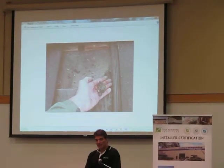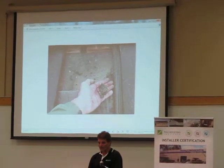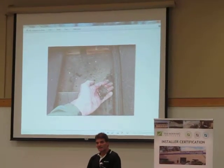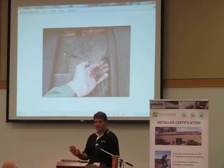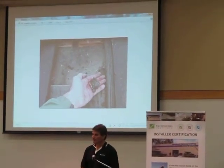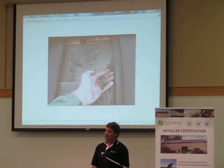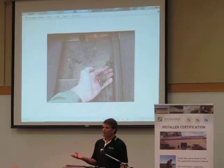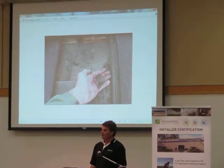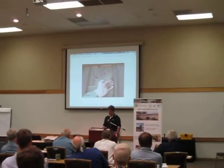You can see how that water channel has two little troughs to direct water downhill. That sediment was causing the water to overflow. It doesn't mean the roof needs to be replaced — it's not a manufacturer issue — it just means the roof is really dirty. It can be more problematic around busy streets where there's a lot of rubber from traffic, and in the city where there's more pollution it seems to be more common.